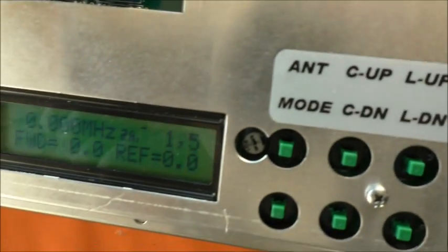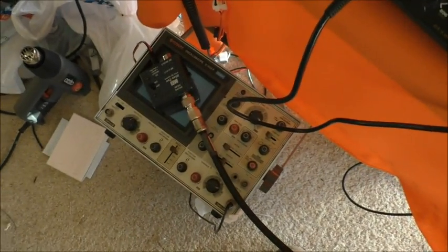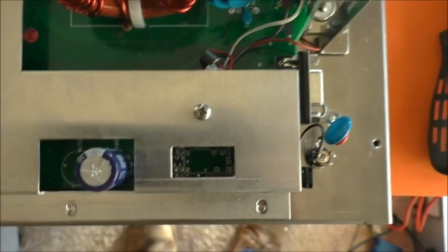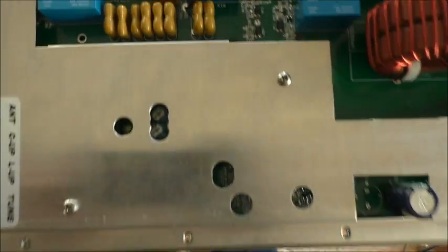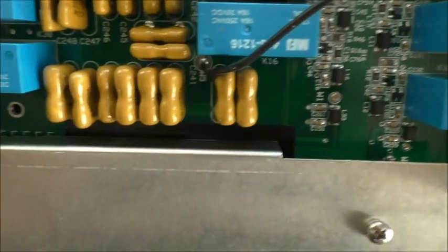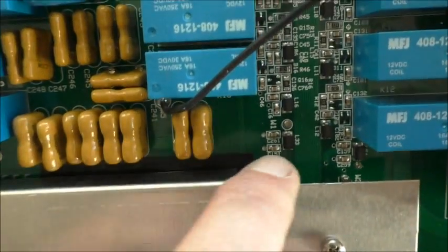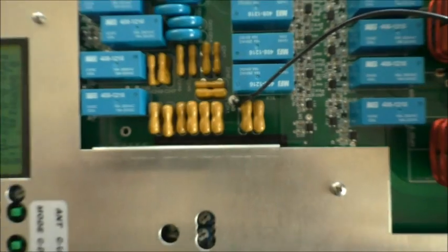So I've got it powered again — there we are, powered up, it's all looking good. It's powered through the coax via the BIAS-T, so the power's going through my new RF choke and the new diode that I've fitted that's under there. With a little bit of luck, that will be the end of this particular device's woes with regard to shorts on the 12 volt rail.